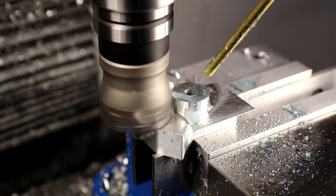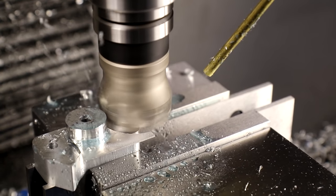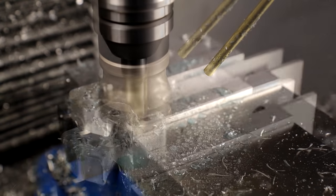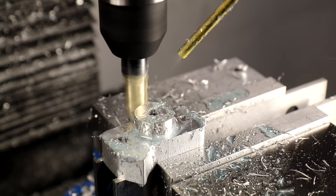This can be worked around with careful control over the amount of material left during roughing for finishing. With insert tooling, I don't notice this problem. Even after roughing, the floor is pretty smooth. Traditional end mills do work well for finishing vertical surfaces. Just keep it a few thousandths off the floor.